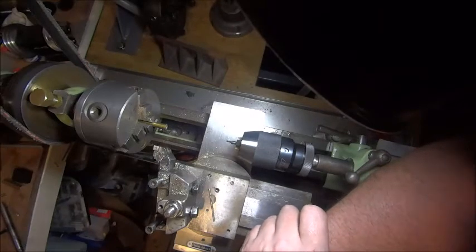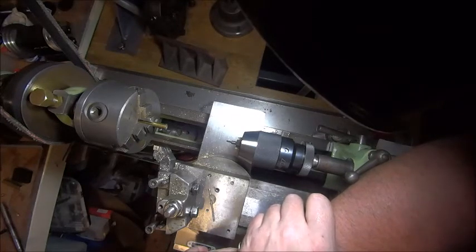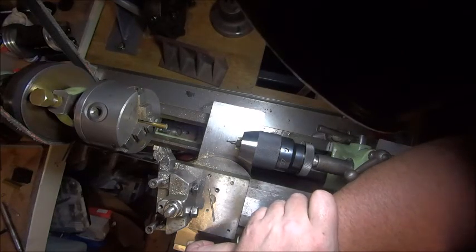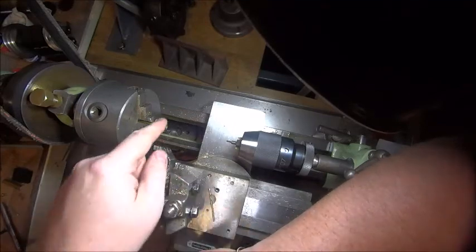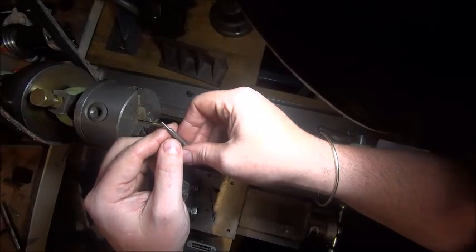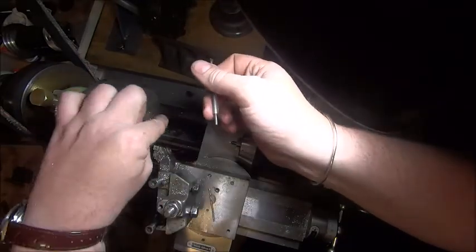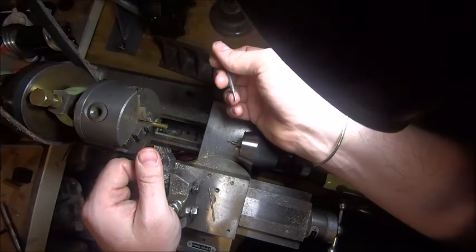I haven't put a lot of effort into hardening and tempering it - I've just done it by eye, and that's pretty good enough for brass and aluminium. If you are drilling or cutting in steel, maybe a furnace and a temperature pencil or a thermometer or something like that will give you a more accurate measurement. For what I'm going to do with that, that's plenty good enough and it's another job done. What I'm going to do is drill this a bit deeper - this runner's got a little bit of a bend in it still, I'm going to use that to see if I can straighten it a little bit, and then we might make a video a bit later on about making a proper pulley. So that's the D-bit, how it works and what it does. Thanks for watching guys and more soon, thanks for subscribing too.